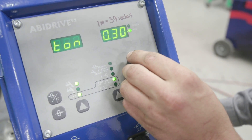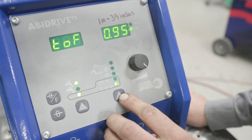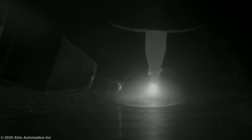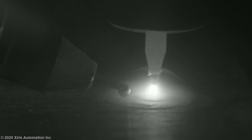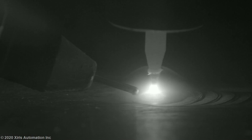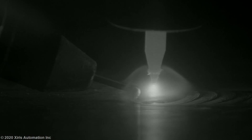On the cold wire feeder, we're leaving everything the same on the Everlast TIG machine. Pulse on is going to be 0.40 - four tenths of a second. Pulse off is 0.7 - seven tenths of a second. Let's go ahead and see if it works. We'll let it warm up and then add wire. Here we go - let's see if this timing's right.